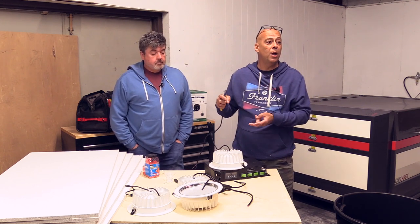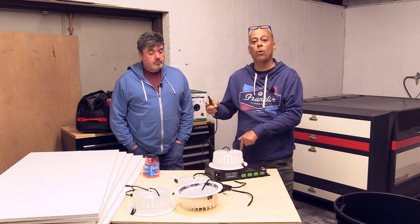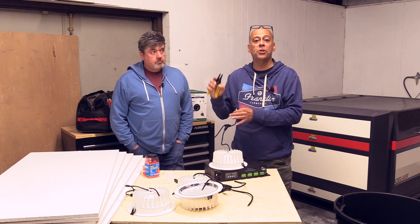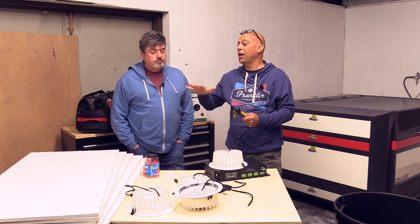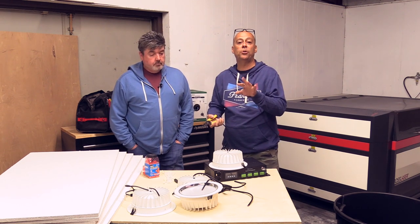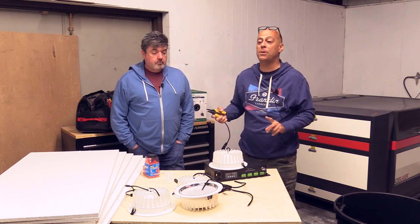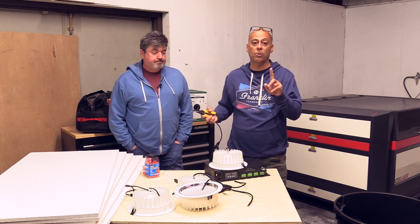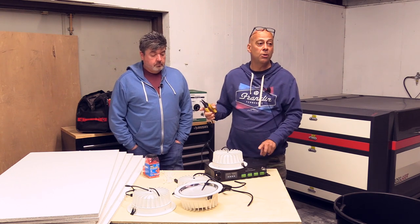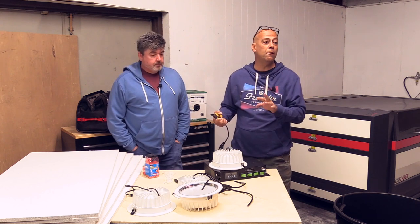Two, you can run it either in warm white mode or you can run it in RGBW. If you run the warm whites in RGBW, you get this benefit that you don't with the color. You can set it up to control four zones individually. So channel 5 is your dimmer, which you must bring up. It's your master dimmer. Then faders 1, 2, 3, 4 control four different zones, so you can split it up that way. You cannot do that on the RGBWs because it all works as one zone. So all 16 lights, or as many as you put on here, maximum 16, you operate as one DMX address. It's still five channels: dimmer, red, green, blue, warm white.